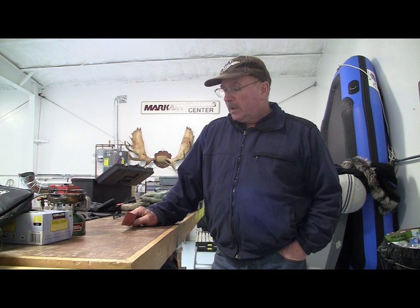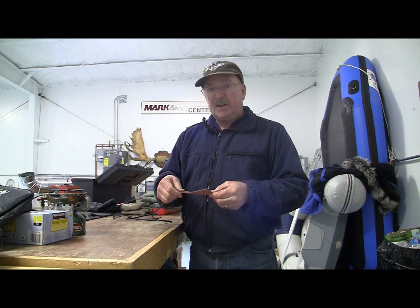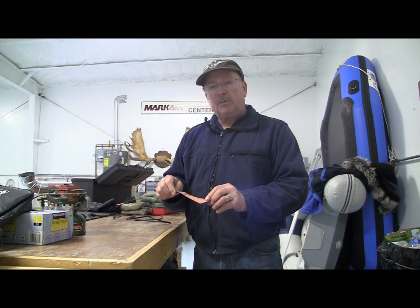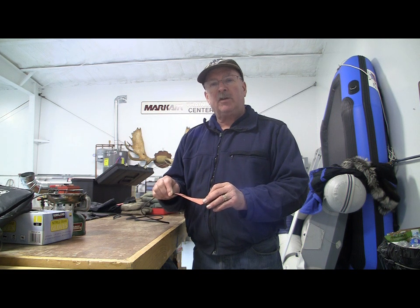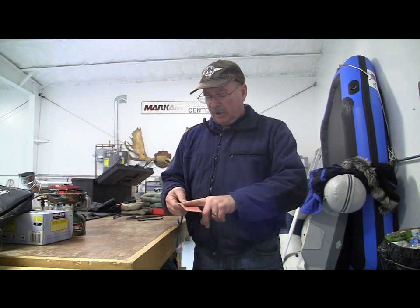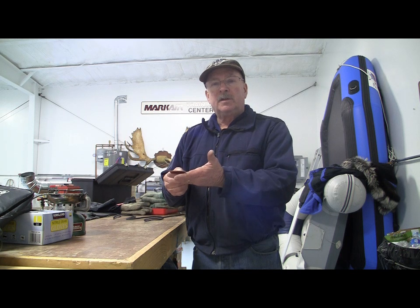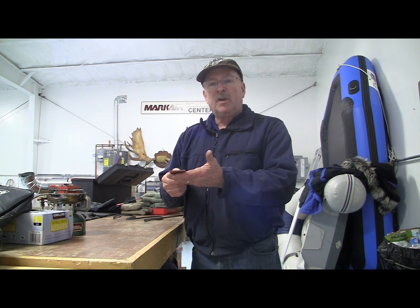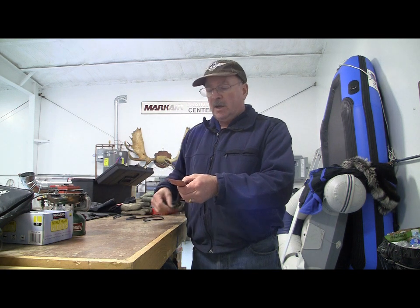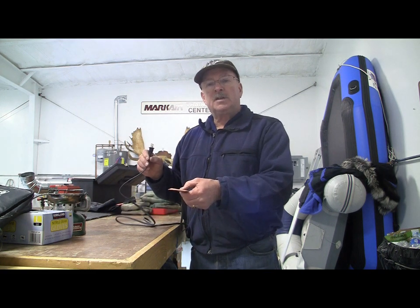The very simplest internal preheat system would be comprised of a silicone pad heater. This is a small 50 watt heater. If I was to use only a silicone pad heater, I would either use a 200 or 300 watt silicone pad. You get a layer of silicone on the pad, and then you attach it to the bottom of your oil pan and secure it for 24 hours with like duct tape. And once you pull the duct tape off, this is adhered permanently to your engine oil pan. And then you can route this up to your oil door, and you've got your engine preheat set up.